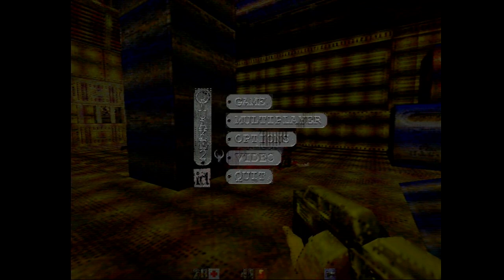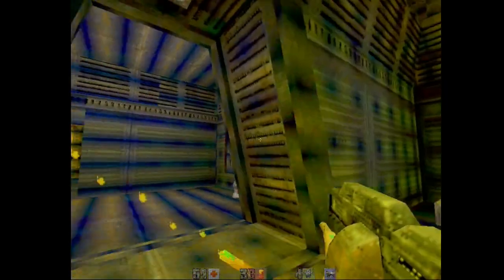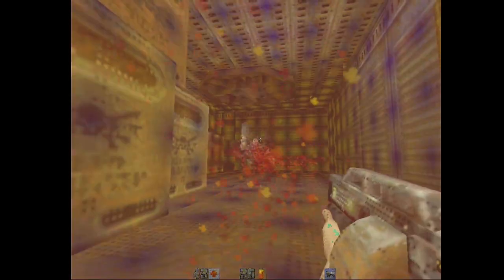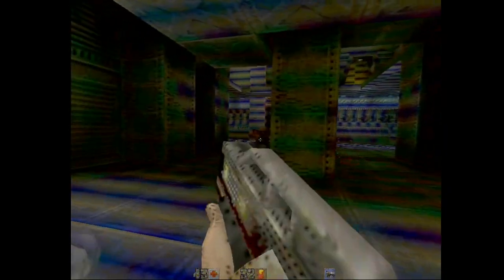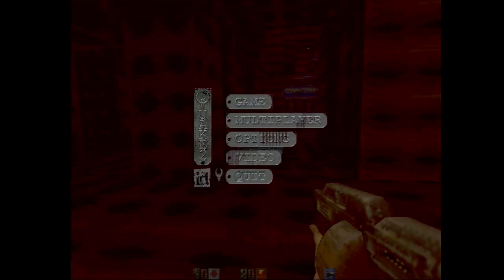That could be loose pins on the TMU or RAM, or it could be something broken with either of them, but that is basically lost bits. So I've seen this problem with pins on the TMU being loose. So you can see the same thing on the guns, these black dots. That looks like a dead data line or something. You see it on the floor too. So it looks like a texture problem we have, but the card runs, so that's better than three completely dead cards, I suppose. But we have issues to resolve, that's for sure.